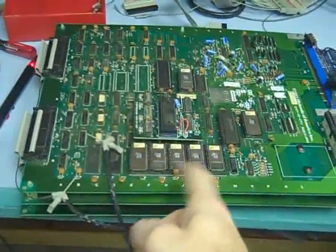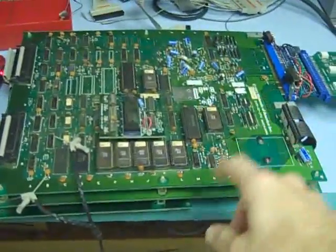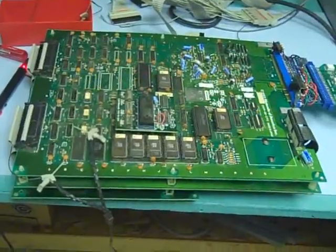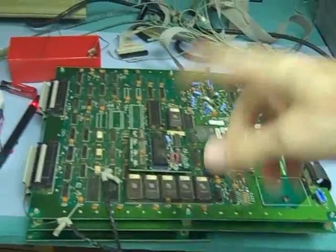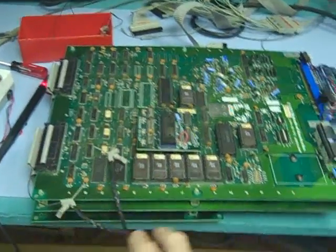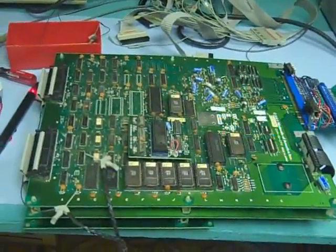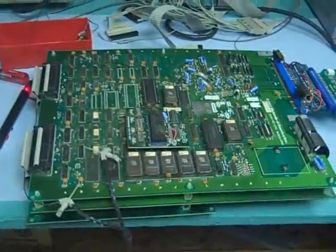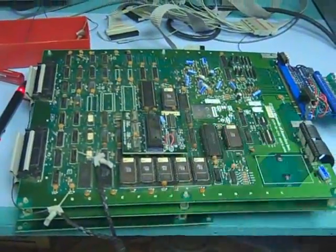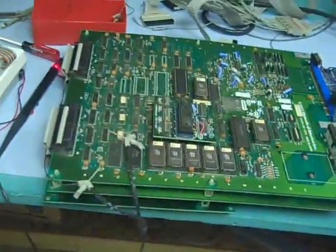It may be that the CPU board — the top board in the stack — is fine and something is going on with the video PCBs. One thing that's unique about this game and some other Nintendo games is DMA. What this PCB does is take graphical information, dump it into these RAMs, and then during a video blank it copies those contents and dumps them onto the two graphics PCBs. That information then gets sent to the sprite ROMs to boot the sprites to the screen. It may be that the DMA is sketchy. I'll throw the Fluke on here, check the ROMs, do RAM checks, and see what's going on — I suspect it's the DMA but we'll see.